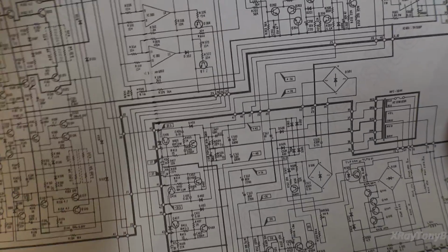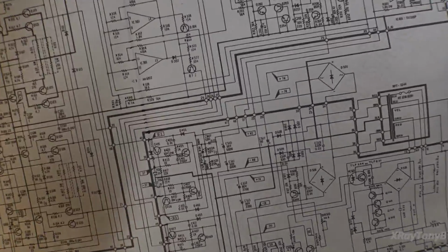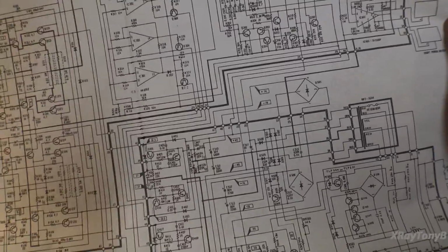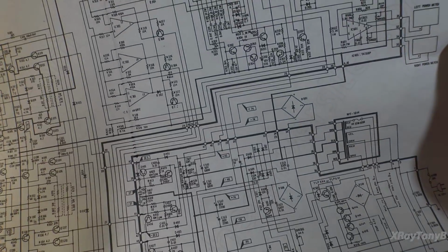But the bottom line is that whole process of switching has to take place very, very quickly. And although we may not have a 4 megahertz or 20 megahertz signal, the problem is that transition frequency also dictates how fast the rise time is. In other words, how long it takes a transistor to react and turn on.